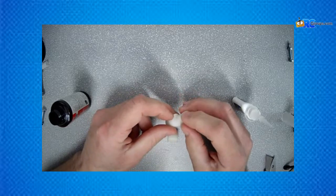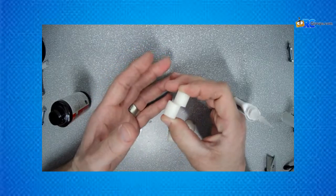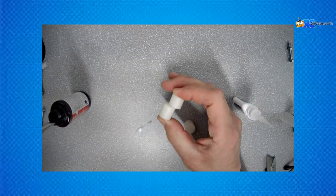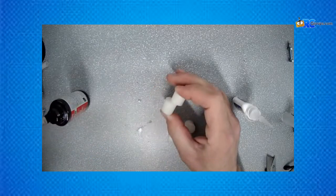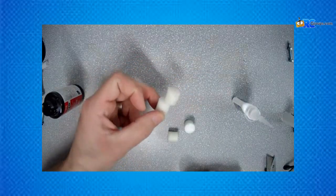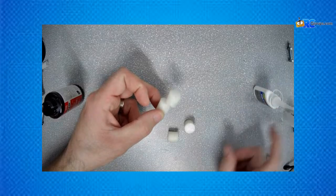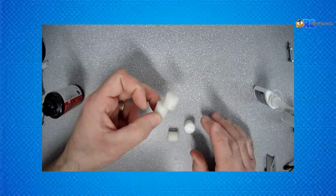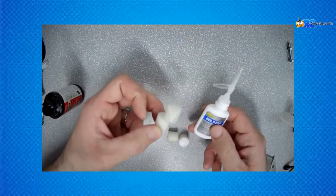I want to get a good grip and hold on it. You want to fixture it and give it time, or — for our viewing audience — I'll go ahead and accelerate it. I'm using a little acid brush so I'm not spraying it all over. What you're doing with the kicker is kicking the outermost edges of the glue to lock them into place so the innermost glue can dry as well. There's a chain reaction that bonds it all the way through.